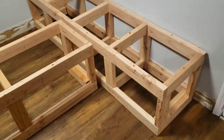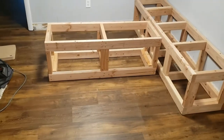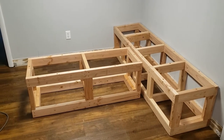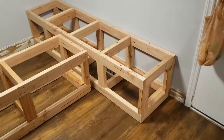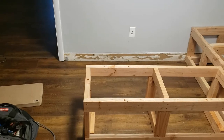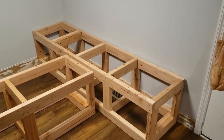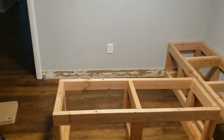Good morning. I'm going to pick up where I left off — we're going to install the benches today for the banquette. I wanted to give you a couple of tips before we get started. First, I took the trim off that was around the baseboard and we'll cut that and put it back on the ends a little bit later. We're going to attach the top, which is a piece of oak, by drilling up from the bottom.